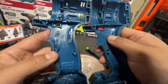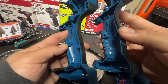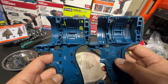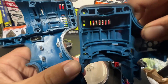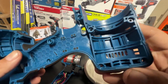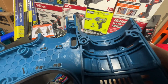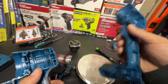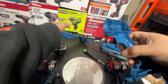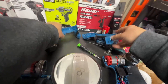They have the same anchor points for the overmold, just eight points here and then a couple more here. Overall I'd say these are the same mold with just a couple little changes, because these are almost exactly identical. It is 30 percent glass fiber reinforced — PA-GF30 — right there molded into the housing. This Gen 2 one feels a lot more stiff; the Gen 1 has a lot more flex with the same pressure applied. This one will for sure outlast this one.